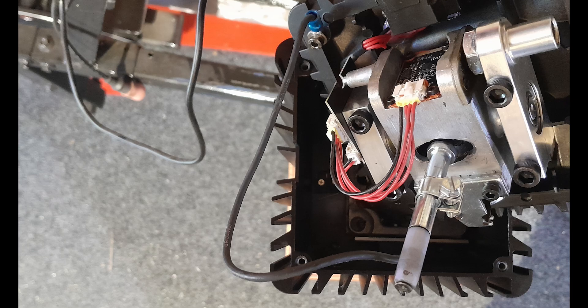So this is proof of concept that this fixes the shifter. Once I retightened that little clamp and effectively re-grounded the shifter, no more mis-shifts again. So this is a permanent fix, given that sometimes you may need to check this little clamp and make sure it is tight and that your ground is tight. Grounding is supremely important in the world of electronics, and as a builder and teacher of motion simulator platforms, I know this firsthand.